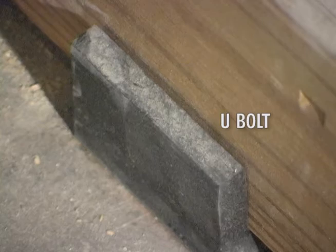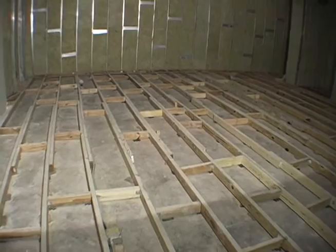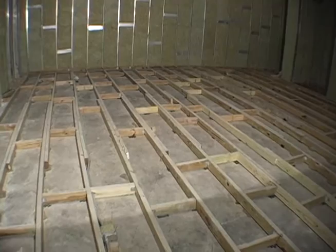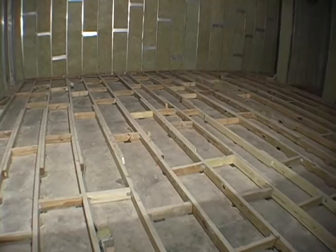And if you notice, I have pieces of wood that are placed between the 16 inches of floating floor. That is to keep the floor very firm and sturdy. So when you're building a studio, just take small pieces of the same 2x4, stagger them between the 16 inches, the two main pieces of wood on the floating floor.